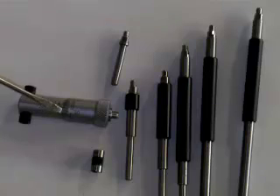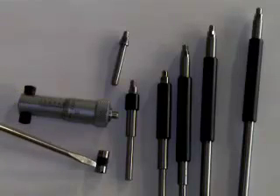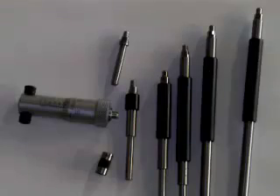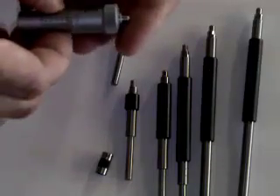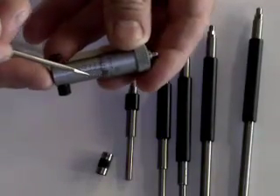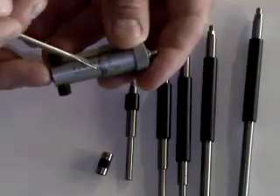The main scale here will read up to a half inch, so it'll read from two inches to two and a half inches. If I need to go from two and a half to three inches, this spacer would then go in. The scale on it is the same as found on your micrometer — the difference is it goes from zero to half inch.